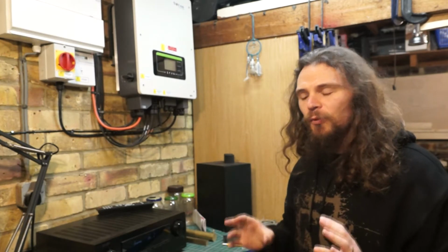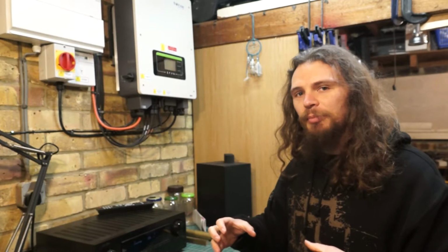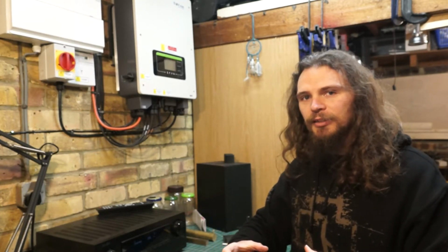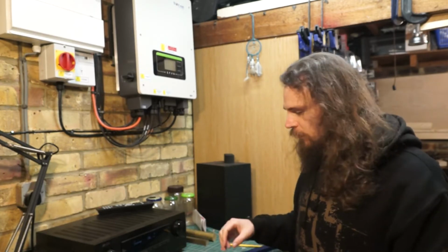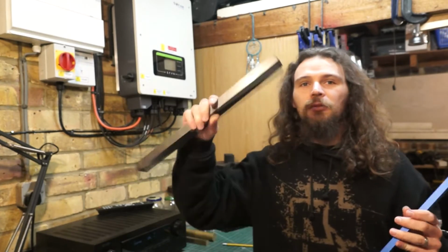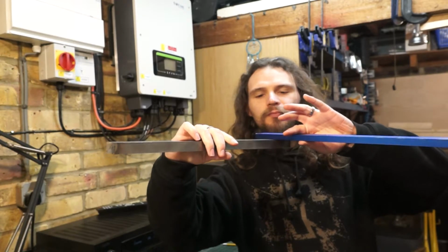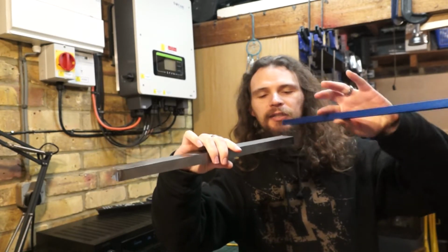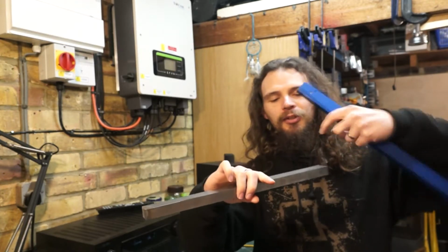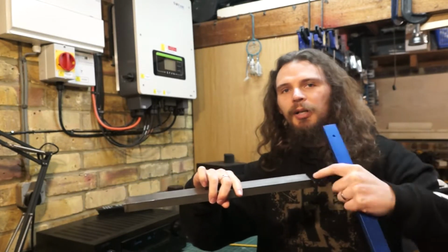I think for the clamp that was going to sit on the tripod and hold everything, I'm going to have it slightly bigger so it's nice and secure. Not so worried about weight because it's going to be directly over the centre, so it's not going to cause it to topple. So I've just gone for a big block like this. I'm going to mill out a slot just wide enough for this to sit like so. Going to have it sort of sit down, but sit just like a millimetre proud. Now what I'm going to do is I'm going to have two bolt holes either side of it, and they're going to screw down with a plate across the top, clamp it all nice and tight.